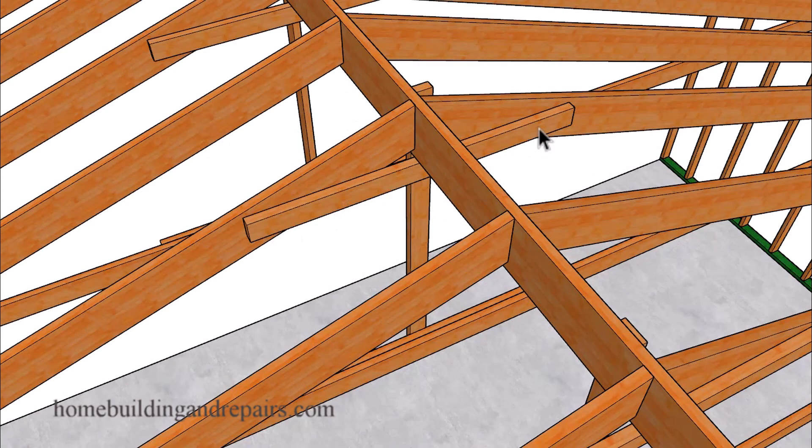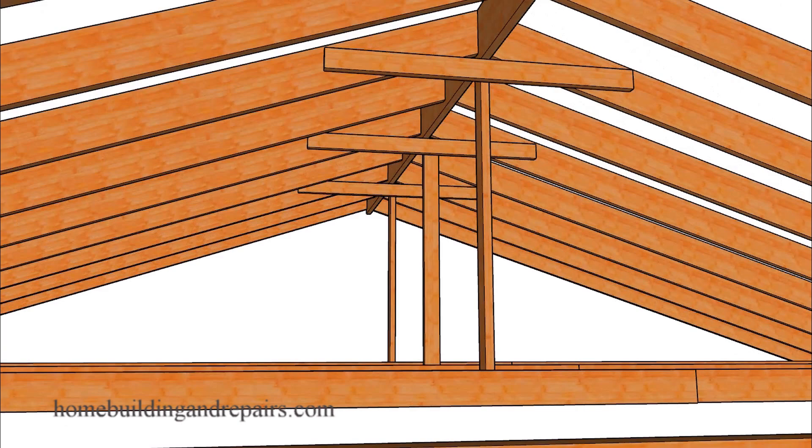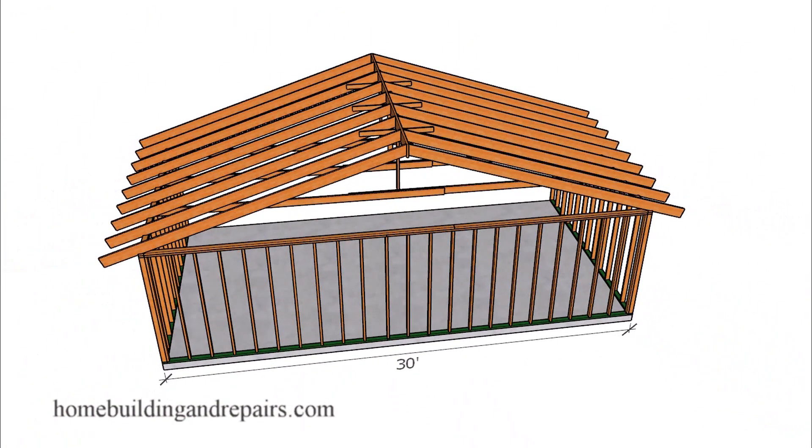Your collar ties — a two-by-four will do, or a one-by-six. The collar ties, along with the rafter ties, cannot be spaced more than 48 inches on center. However, you would need to check with your local building codes to verify that information.